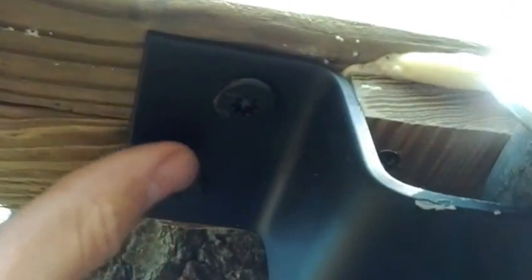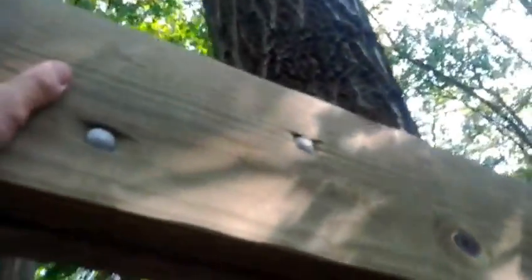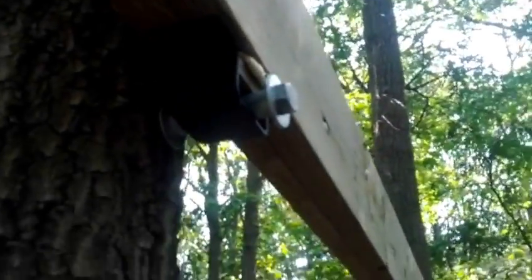The first beam is attached. Here's the metal strap — it's attached with wafer-head decking screws, the kind with a big pancake head I've been using in the shop renovation, so I was able to install them without a washer. They're four-and-a-half inches long, so they go way up into the beam. There's plenty of space on both sides and in both directions. It's stiff — I can't really move it by tugging — but that's fine. I don't want it slopping around.